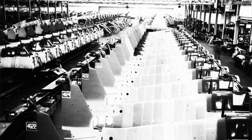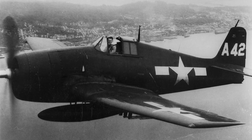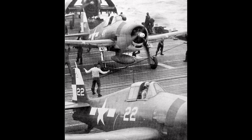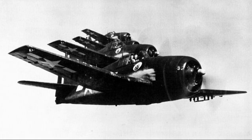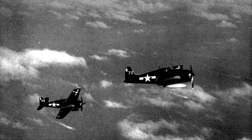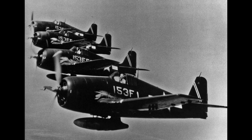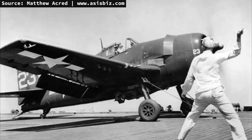In April 1944, Grumman began production of the improved F6F-5. It technically was not a drastic update from the F6F-3, as many minor improvements had been made throughout late Dash-3 production. Late F6F-3s and early F6F-5s were virtually externally indistinguishable — only the bureau number and paint scheme would determine which aircraft one was looking at. An overall gloss sea blue aircraft was more likely an F6F-5, while a tri-color aircraft was likely an F6F-3. The F6F-5 powerplant stayed consistent — a Pratt & Whitney R2800-10W water-injected radial — with top speed reaching nearly 400 miles per hour and an increased rate of climb.